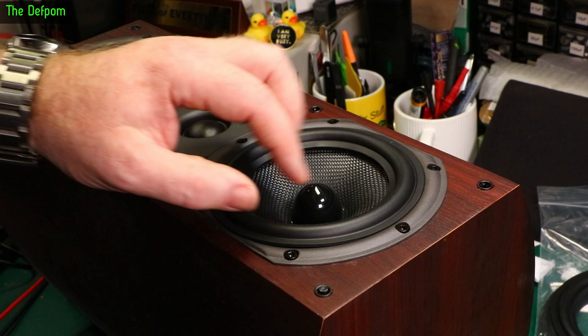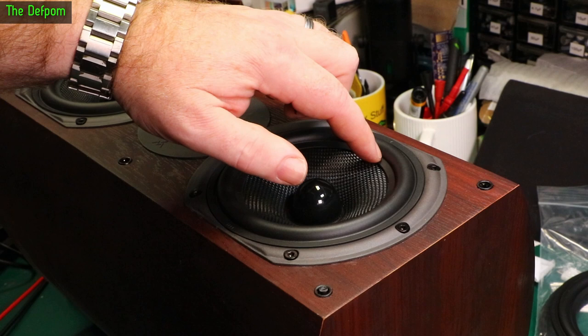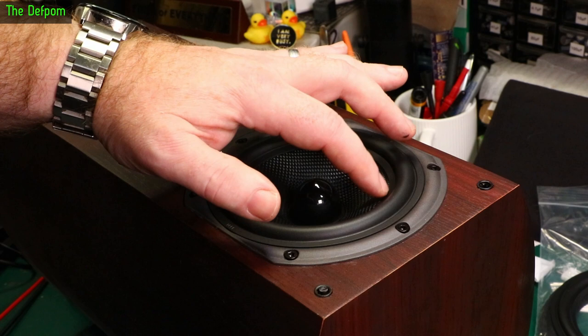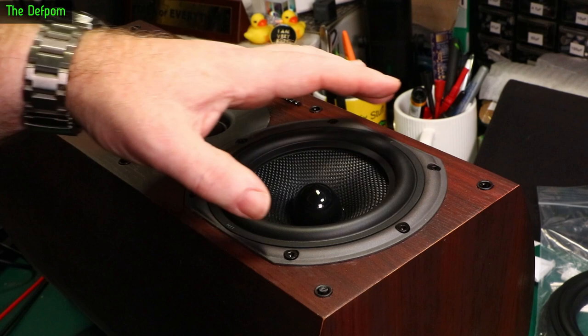The trick to that is to actually put DC power onto the speaker and cause the speaker cone to shift. I've found about six and a half to seven volts is enough to get this cone to move enough. I'll drop it down very slightly to six and a half — that'll shift this out. So now it's just touching the cone. When I go to glue that, I can have it there — that means I can set the glue in place without it trying to pull back off. We do the inner part first, let that dry, and then we do the outer part. That's the key to get the alignment right. If you don't get the alignment right you'll have trouble with rubbing.